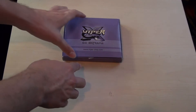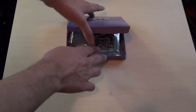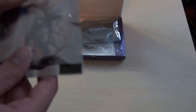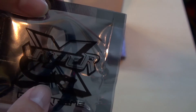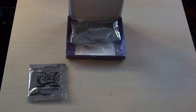Inside the box really isn't all that much either. There are only three items that could possibly be inside. First item is the actual mod chip itself — this is new old stock. Inside the packaging you have a little ribbon cable to connect your chip to a bridge, and four wires: red, black, and yellow. These four wires are what you would solder to four solder points on the GameCube. One thing this chip boasted was easy installation — you only have to attach those four wires and that's it.